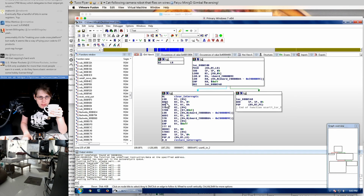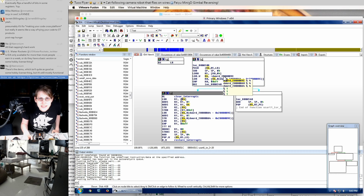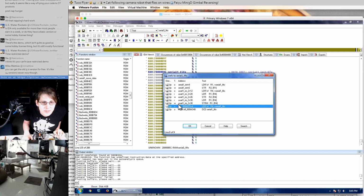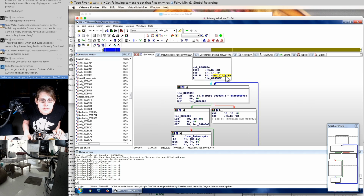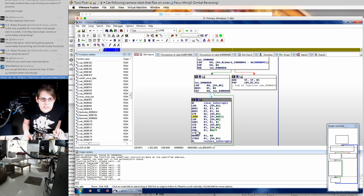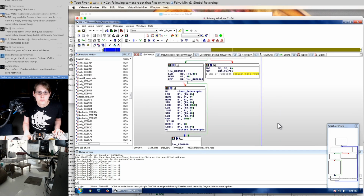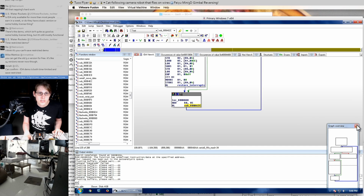Critical section over here, I'm guessing it's storing stuff in a FIFO. Is this the address we prepared earlier that points to the data register, maybe? So the serial 1 FIFO is used in the serial 1 init, in the ISR, and then maybe this is part of what we're looking for down here. Serial 1 FIFO. Looks like we're reading bytes out of the FIFO here. Okay, so this is actually like a polling function and it sends the results right here.